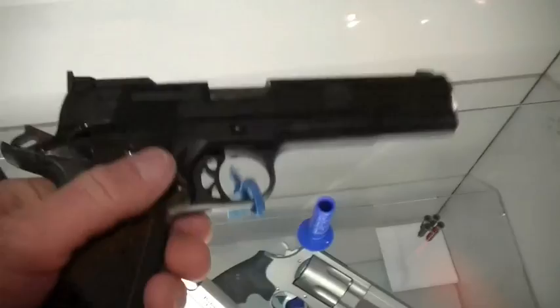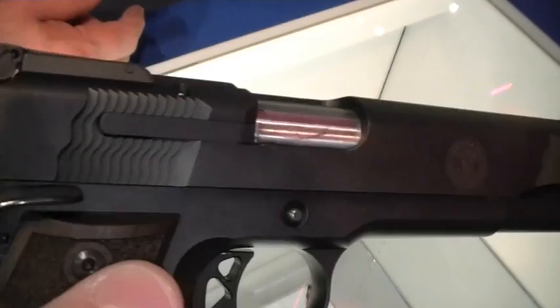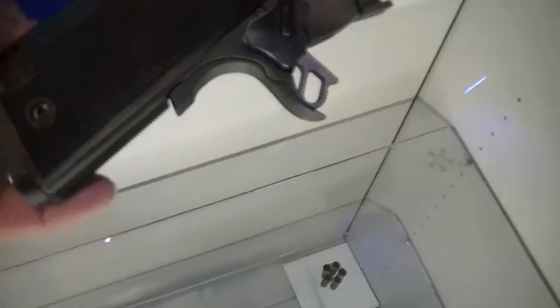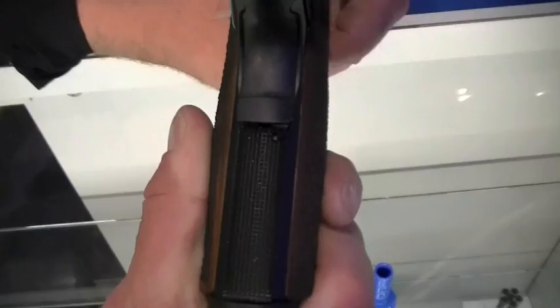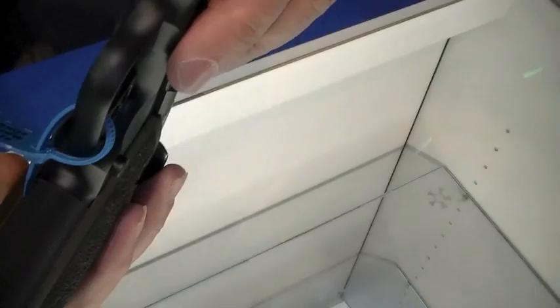This other one — I really like the looks of it. Black tactical. It's a 1911 platform with a Melonite finish — stainless steel with a Melonite finish — built exactly the same way as the 945 PC. They machined the rails on the slide and frame themselves, lapping with Babbitt hammer for the first strokes, then by hand with multiple grades of compound. These are my favorite grips — walnut, select walnut stipple grip, made by Rocco Grips in Bandera, Texas — beautiful and functional. Nice serrations on the slide too, with a palm swell grip and 30-lines-per-inch checkering on the backstrap.